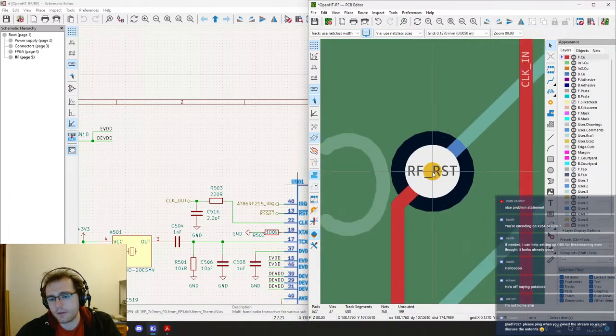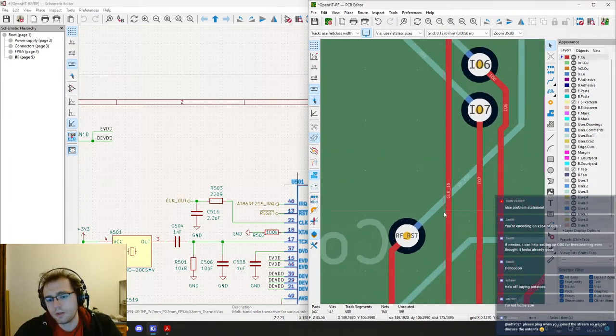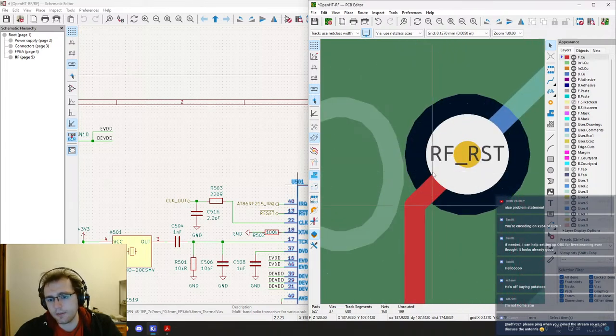So basically you have an acute angle like this with some acid which might not be rinsed off properly after the etching. And so if this stays there, this can cause problems in the board. I have never experienced it personally. I haven't done thousands of boards either, but it's just good practice to avoid doing that. So yeah, just like this is enough.